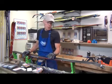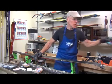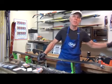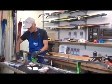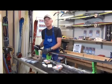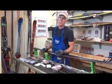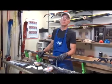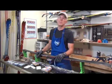To summarize what we've gone through today: the key is a good digital iron — something with a microprocessor that will hold the set point, with a heavy base. You need a sharp scraper and a scraper sharpener set at 90 degrees with a file specifically for plastic material. And a good set of brushes: a soft stainless steel brush, a horse hair brush, and a nylon brush. Thanks for watching. If you have any questions, send us an email or give us a call — the phone number is on the website.